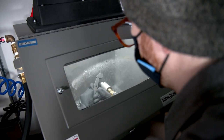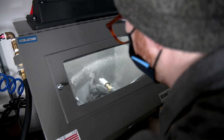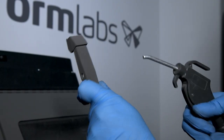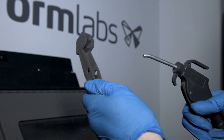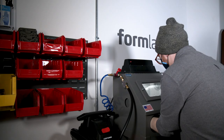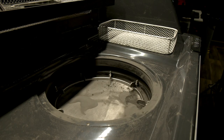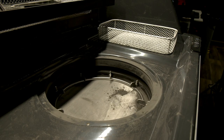A jet of air and fine glass beads helps to remove excess nylon powder from the surface of the printed part. Finally, a burst of compressed air should be used to remove any stray blasting media that may have been left behind. If using a media blaster, be sure to keep it separated from your Fuse Sift workstation, as blasting media can negatively impact the print quality of your nylon powder.